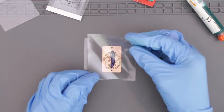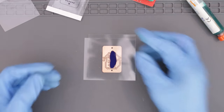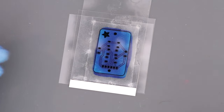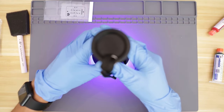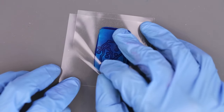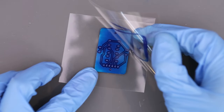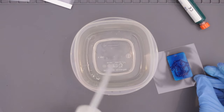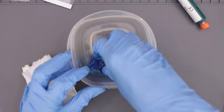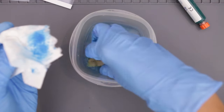I did some more tests and tried out some different pigments since I had some extra samples to work with. Again, following the same procedure and about the same amount of resin and exposure time. I could never quite get perfectly even resin, and I always ended up with some thin spots. I found this to be a little annoying and went through a few fails to get it this good. This process requires a balance, and admittedly, I had more fails than successes. I think the failed PCBs could probably be salvaged, but I found it kind of laborious to clean up, and honestly, it doesn't cost me much to throw them out since I can just mill more in a few minutes.